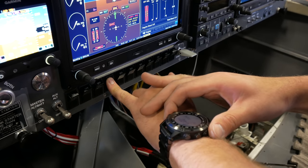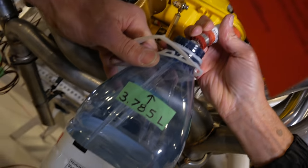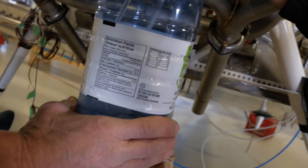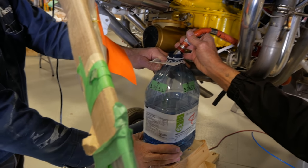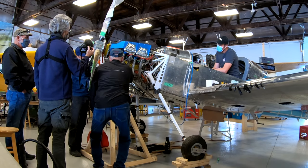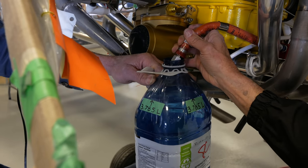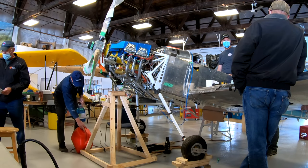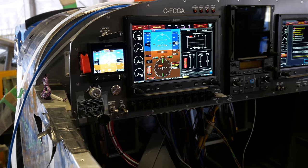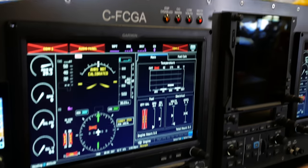In preparation for inspection, we had to do a fuel flow test. That's quite manageable, that flow rate - I was afraid it was going to come out like gangbusters. It's indicating 45 gallons an hour - we'll cross check the map to verify. That's 50 gallons an hour. We need 50 percent more than 16 gallons an hour, so we needed around 22 gallons an hour - this is well over double that. Then we sealed everything back up and pressurized the system to look for leaks.